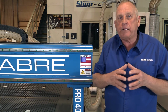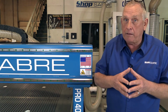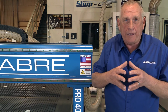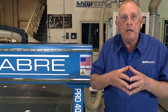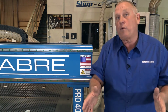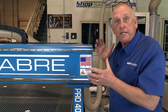Now, let's talk about that a little bit. Sometimes we get a question: are ball screws better than rack and pinion? Well, the answer is yes. They're more accurate, they don't have play in them. One thing that's really funny, some people who only have rack and pinions will try to tell you how good they are, yet they use ball screws on the most accurate axis, the Z-axis, because it controls depth. We use ball screws because our design criteria is to create a machine tool grade CNC router, therefore we have to use ball screws. What makes the ball screws move are motors, and we use closed loop servos, and they're Mitsubishi. So the Mitsubishi motors and drives are matched for this entire system.